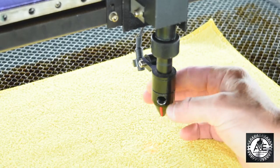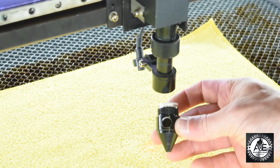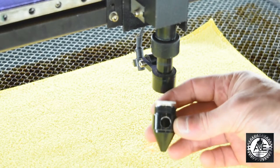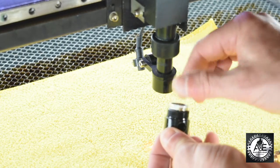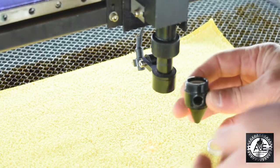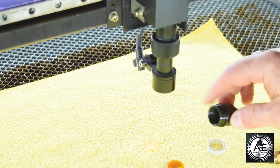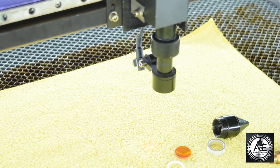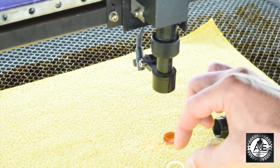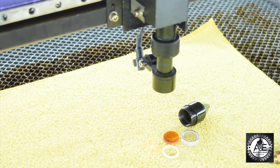You're now going to unscrew this elbow. And now we can take off the nozzle tip. Now that you have your nozzle off, you'll see this is what it'll look like. You'll probably have this little compression top here that's going to hold a spacer in. If we dump this out onto a microfiber cloth, you'll see that you'll have your lens — try not to touch the top of it — and the spacer. So you have your lens, the spacer, the compression thread, and your nozzle tip.